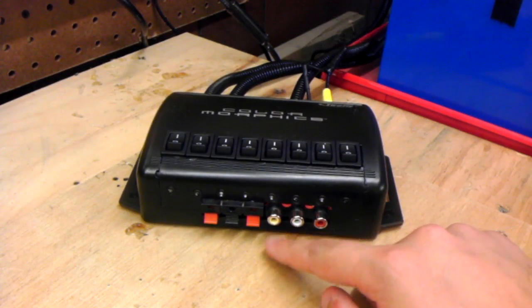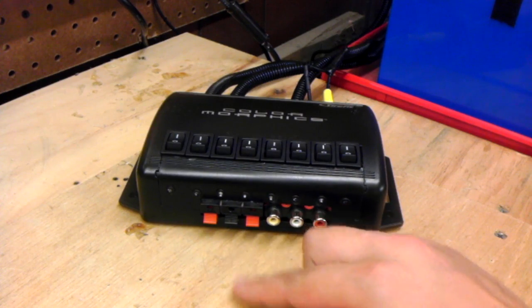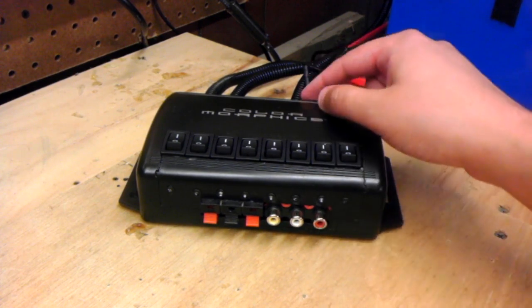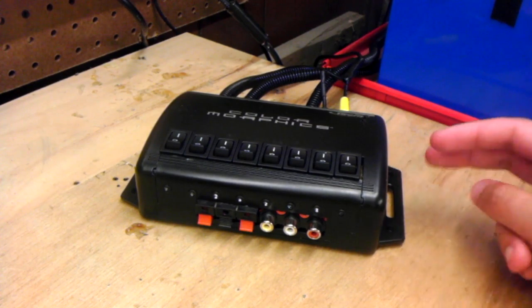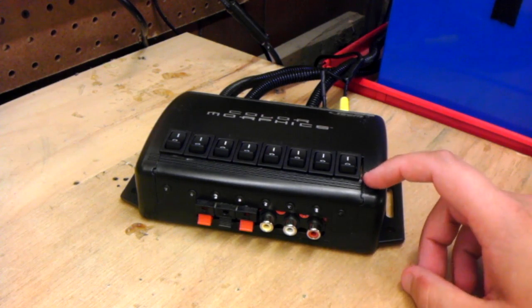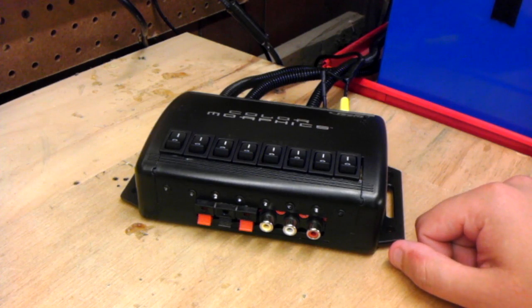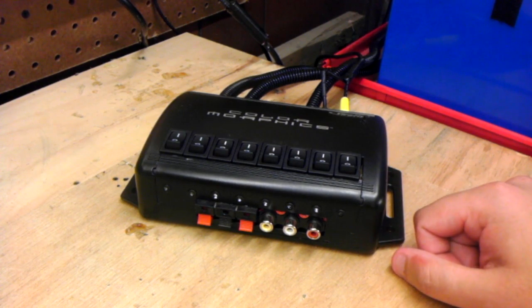In the front I have some audio-video ports, because on top of having voltages that are easy to quickly connect to, having video inputs and audio inputs, as well as a video output and power output for a screen is important. I have a 3.5-inch screen hooked up to the top of my monitor. I built an audio amp and two speakers into the box so you can tell if left and right audio channels are working. Next I'll hook it up to some LEDs and my voltage meter so you can see what I've got to work with.